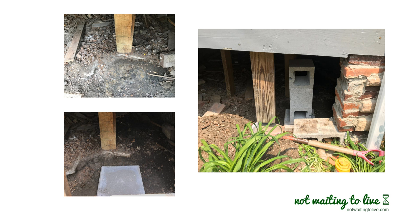Here I cleared out the area next to the sinking column, got down to where I was scratching some clay, and put down a 12-inch by 12-inch square paver block — it's about an inch and a half deep. I just made sure it was level; that was just for a foundation so I could stack some concrete block cubes. These are eight-inch by eight-inch by eight-inch half concrete blocks. Those blocks are a dollar fifty a piece, and the paver block might have been two dollars. This just gives me a foundation to put the jack on top of.